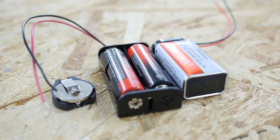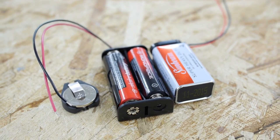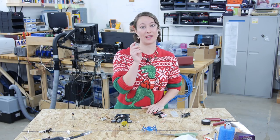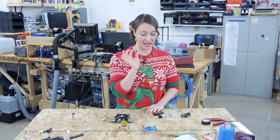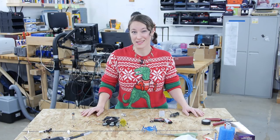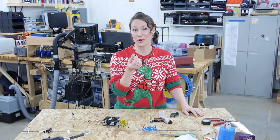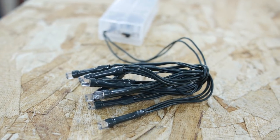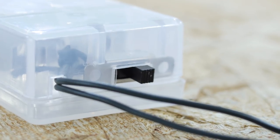So let's look at our battery choices. To get 3 volts we can use either a 2 AA battery pack — because each battery is 1.5 volts, so times 2 that equals 3 — or we can use a button cell battery. A CR2032 is also a 3-volt battery, so we can get a pack like this. If we need a little more oomph we can use a 9-volt battery with a snap. Getting these parts doesn't have to be expensive. You can pick them up at your local store. Like I said, I got this motor out of an electric toothbrush from my dollar store, and at the same dollar store I found this strand of holiday lights that has a lovely 3-volt battery pack — and oh look, it also has a switch. How handy!